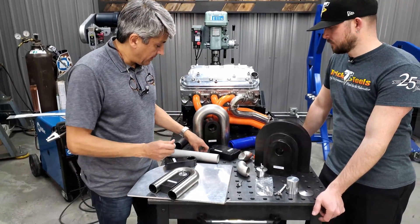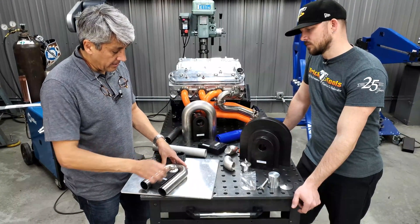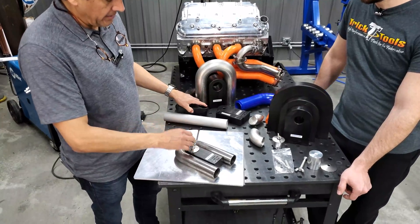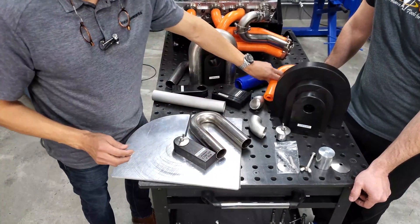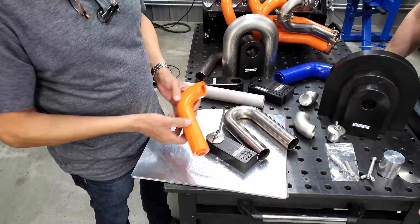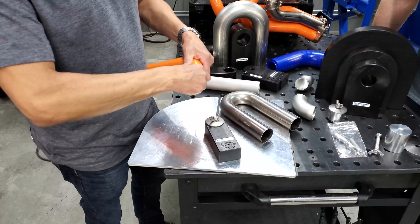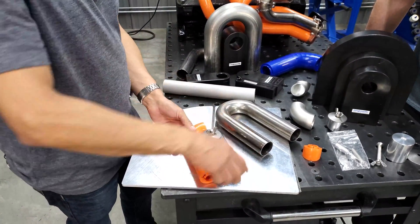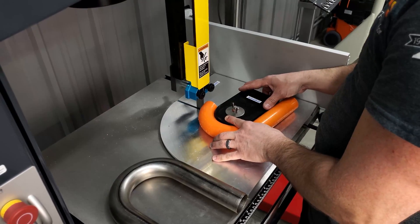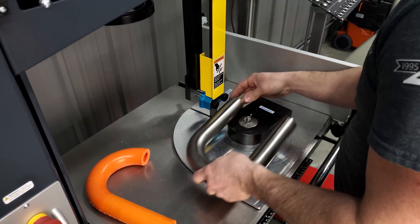The spacers are designed to absorb vibration and allow proper fitting of a U-bend. When we're ready to cut, we add a conical washer that acts as a spring to locate and lock the position, then a wing nut. Once we make the adjustment for the angle we need to cut, it allows us to bring the blade through. The adjustment is very simple — no numbers — just recreating the plastic part based on our control sheet and number of blocks, then bringing it to where the blade can touch. That becomes our stop.